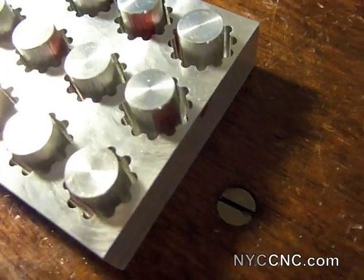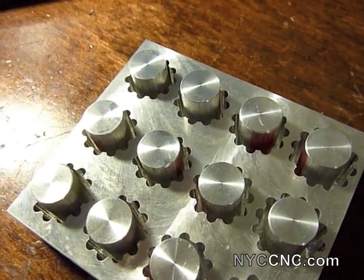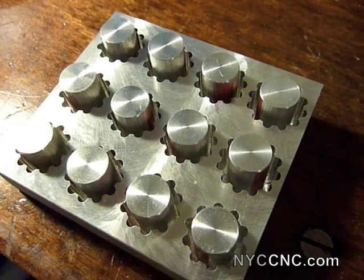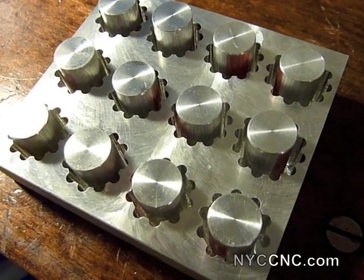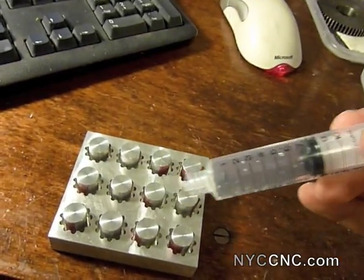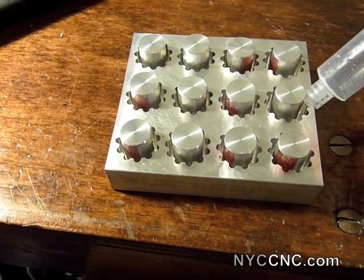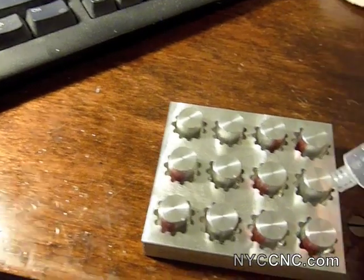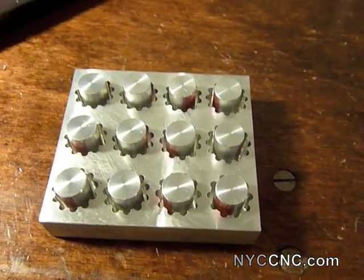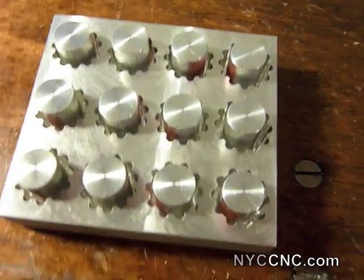You may be wondering how I'm going to get the molding agent in there — that's a good question. From the tutorial videos on Smooth-On's website, they discussed that it's important to pour slowly so you don't create air pockets, and to start the pour from the lowest point of the mold. So I think I'm going to use a syringe, which will allow me to control the rate and direction of the flow. I may also try adding a hypodermic needle ground down to the tip of the syringe, which would allow me to start at the bottom. I'm going to do the casting in a different video since I'm out of time. So that's it for now.